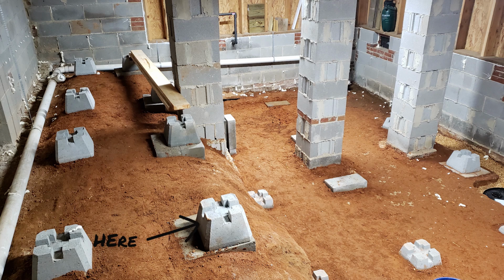Yeah, we had to get that crawl space completed. We prepped for, I'm going to just call it decking. We prepped for that. We removed the soil that was necessary. We put in all of the foundation blocks. Now, some of the framing for the decking could go right on a block that was sitting on the ground. It couldn't go on the soil. Everything's above the encapsulation, but there were areas that we had to dig out and put in a block, and then those footers, for lack of a better term. But all of that wood, it obviously has to be dry. It cannot be touching the soil. So we put those in place, and that's when I went in and started with the encapsulation.